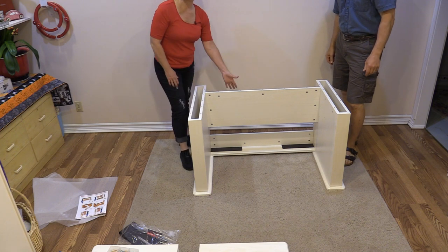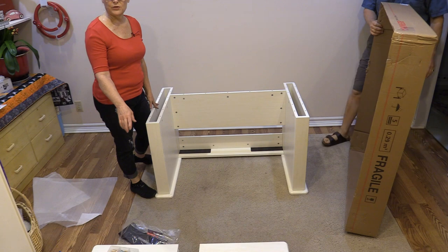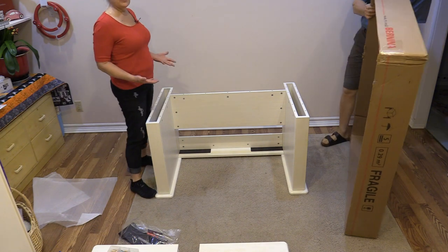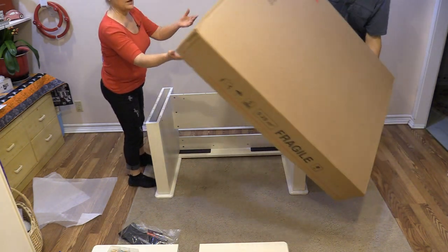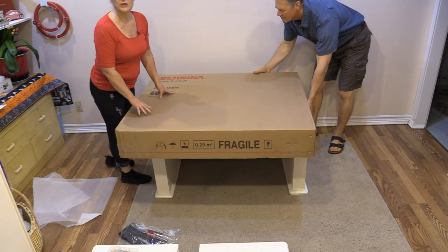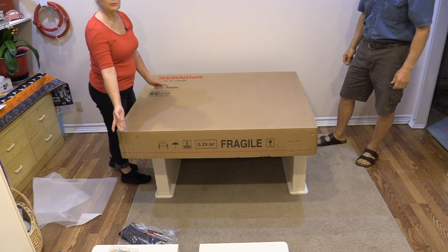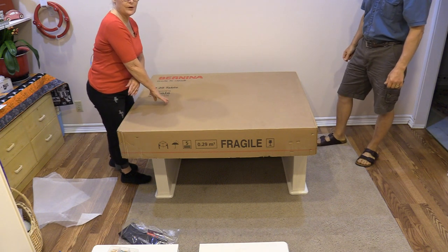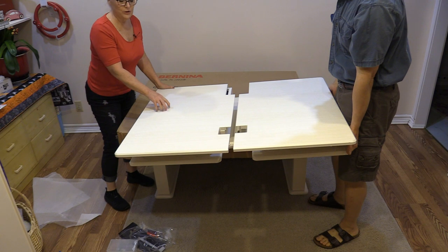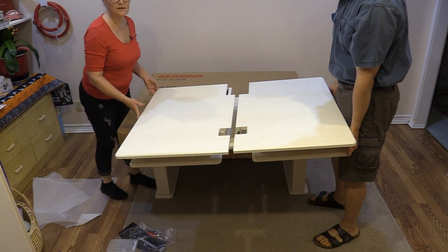The larger piece has screw heads on one side — these screw heads are going to face up and you'll be able to see where they all line up. Just drop it into those holes and tighten the three screws. We need to pick up the second leg and place it right on top — this is where we need some help. You will see where those screw heads will fit all the way into those holes. The same screws we tightened on the bottom we need to tighten on the top. We can then lay the table back on its legs — that's all there is to build the leg portion.